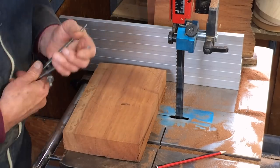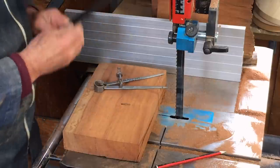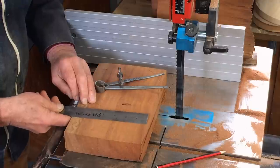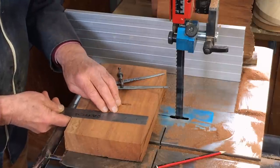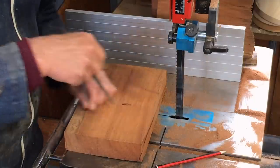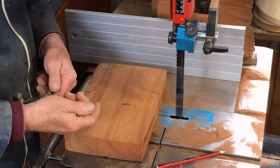It's not quite solid enough for boxes. I could make a little scoop perhaps, but the width I've got here is 170 mil, which is just under 7 inches, so 6.5 inches. So I can get two little 3-inch bowls out of that quite happily, 75 mil bowls. So we'll do that. So I'll step that out. 1, 2, 3, 4. Yeah, just take it in a little bit.